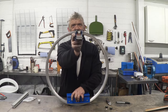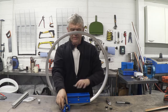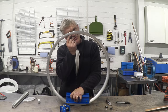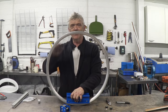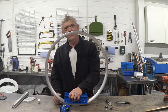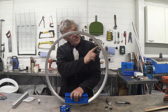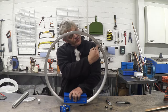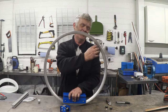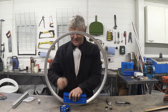One of the reasons these are like that is you can see there's a fair old distance here. And if you remember that thing we did on gears made out of toothed belt, what I'm going to do is buy some toothed belt, glue it onto this rim, so that this whole thing becomes one massive cog. There is one other issue — that's the valve here. We need to re-drill the valve so it sticks out the side and doesn't get in the way of anything, so that we can actually pump it up, repair it, or do something so that the valve isn't catching.